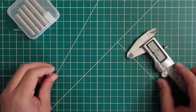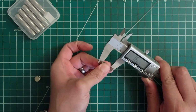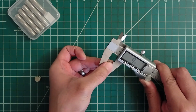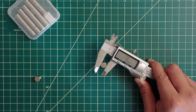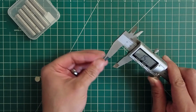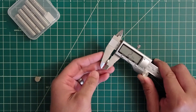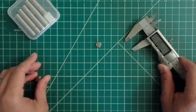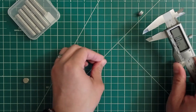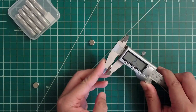First, measure the magnets you intend to use. Despite the advertised product sizes, the actual dimensions of the magnets are often different. It's also a good idea to measure more than one from each package because there are often production variances. After measuring a few, make note of the largest size that does not seem to be a drastic outlier.